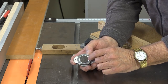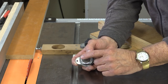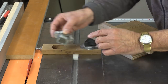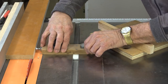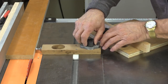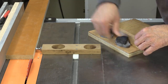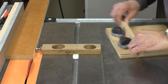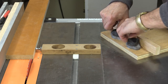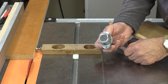So what I did with them when I purchased them — I put a very thin layer of that anti-skid material and I just used double-sided tape, double-sided carpet tape on the bottom of it. So it keeps it all very thin. Now when you put these on and lock them on, it's almost impossible to move that. I used the same thing when I made a fence for my drill press table. When you lock it on, it's almost impossible to move that. But it's easy to move around when you take these off. When you lock them on, they're locked solid — almost impossible to move. And that's because of that anti-skid material.